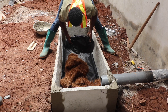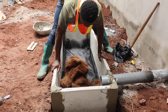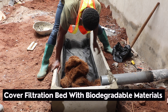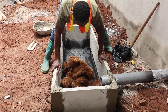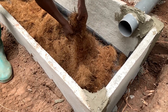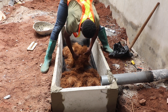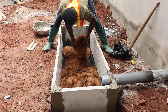The next thing to do is to cover the net with your chosen biodegradable materials. In our case we are going to use beaten coconut husk which has been treated into a fiber — we call them coconut fiber. Ensure that the fiber covers all the surface of the digester bed and is spread all across the digester bed to receive the human waste.